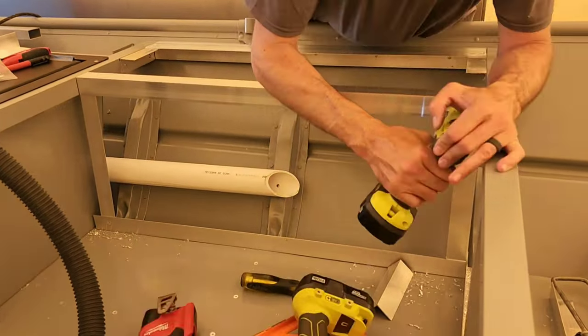I started by figuring out how big the rod rack would be and where it would go. I then made a template. I then made that template a reality by cutting it out of sheet aluminum. And you only thought that 48 holes drilled for the rod locker was enough. I didn't stop there. We needed 10 more for the rod racks. These holes are in line with the front, middle, and bottom holes, allowing the top hole's rods to rest on top of the rack. Demonstration later in the video.